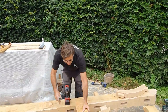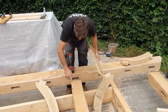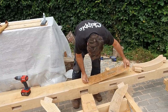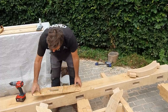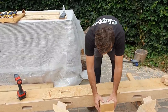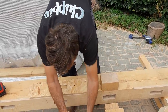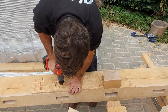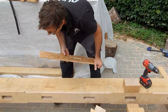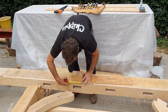I'll also use that template for all my dowel and peg holes from the shoulder — turn it over, pilot it there. This is where I'm going to drill my 20mm holes, and the same along this beam. I've held it against the shoulder of the post, spin it over, do this one here exactly the same — just need an off-cut of that post. What I like about this is there are no pencil marks; we are only working to a center mark quite often.